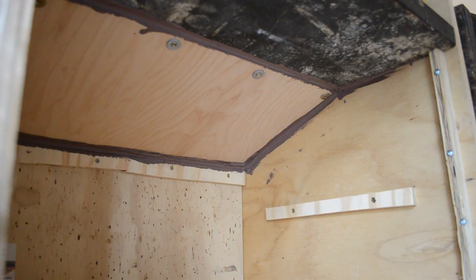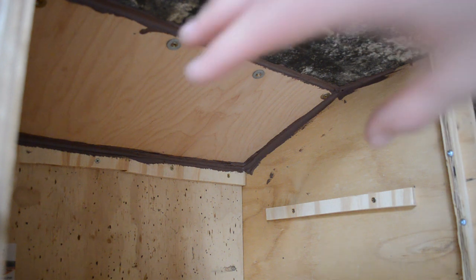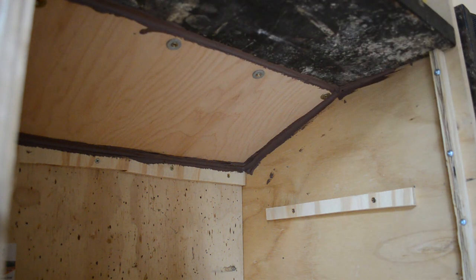So there we go. This thing should now be air and watertight, which I think is going to improve the ability of this to actually work as a downdraft, right? Because now I have a sealed vacuum inside of there all the way back to the shop vac dust collection system. So this should generate a lot more suction than my initial tests when I didn't have this all sealed.